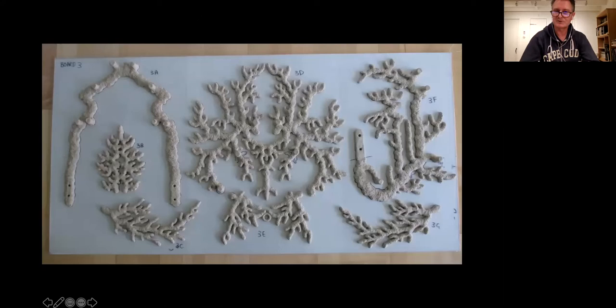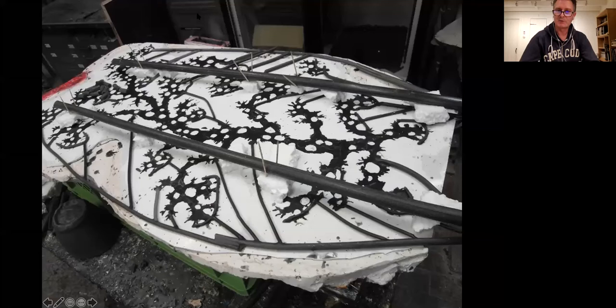So then setting out to create the work, modelling the forms in plasticine. And then creating a rubber mould from which I can take a wax and then embed that wax into a refractory mould and attach wax screw sprues and air risers, which are part of the casting process.